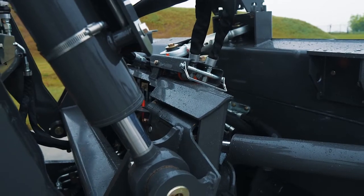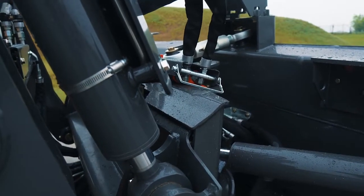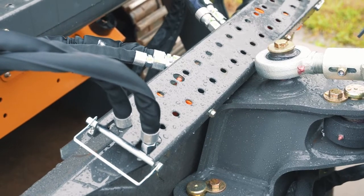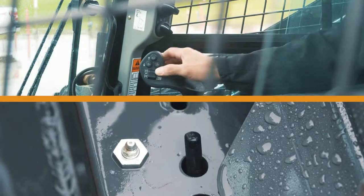As you drive in, you're curling to make sure that you're getting the coupler flat with the C-frame. There's an indicator on the top of the receiver that shows when you're all the way in. Once you're in, you can throw your pins and lock your coupler on.